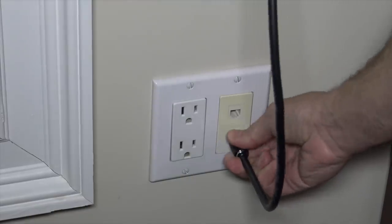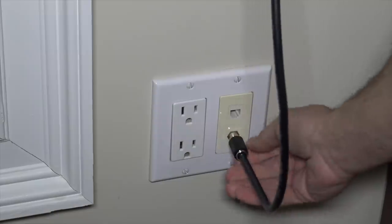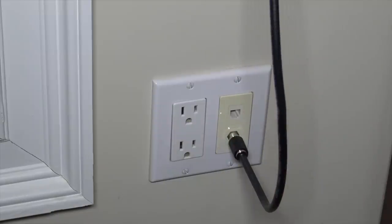People should check that all connections to their TVs and cable boxes throughout the home are tightened up and secure. That's good practice for your cable operation as well as MoCA — it keeps signals that need to stay in the coax inside the coax, and keeps outside signals from getting in and causing interference.